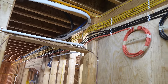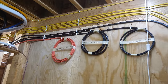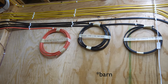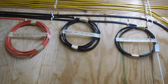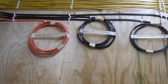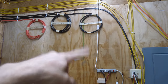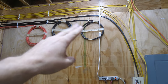I've got that all wired up. With these three large circuits that I don't really have space for in the panel right now, I'm trying to reserve some space for our future sub-panels for an addition and a future house. So I'm not going to hook these up right now because we don't have an electric vehicle, an electric stove, or a need for that shop ceiling outlet right now. Eventually I'm going to put a sub-panel somewhere to the left of our main panel, and those three will be powered off of that if we end up needing them.